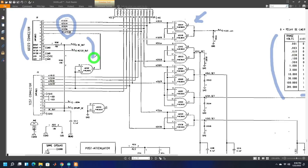We have everything needed: the DC voltage, the range, and the power supply. There is also another connector called a test connector — probably used in the factory so the range can be overwritten via software control rather than turning the knob manually. These bits come in and have the ability to overwrite the front panel hard switches using the NAND gates and pull-up resistors. You could actually make an auto-ranging version of this instrument — it's definitely possible since everything is easily accessible.